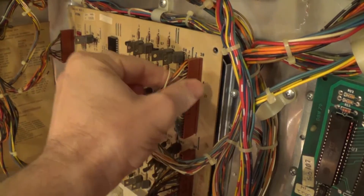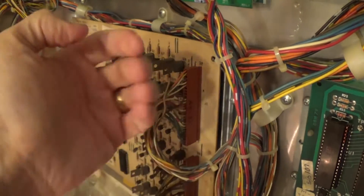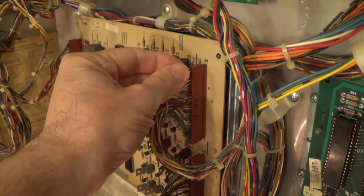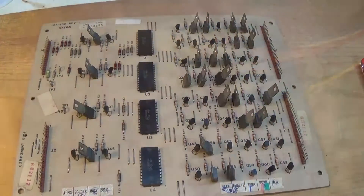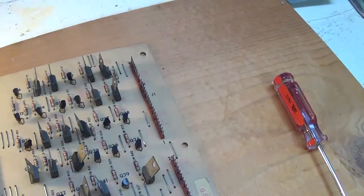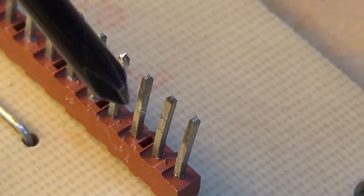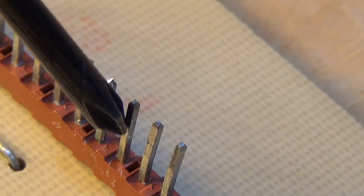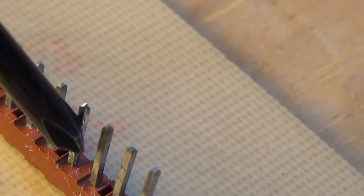So I thought about this actual connector where the wires go in. There's a female end to this connector, and the pins that come out of the board are the male side. I looked at all these connectors — I didn't change any because they all looked nice, new, and in really good shape. I knew it had to do with this plug somehow. So here's the board out of the game. Let me zoom in and show you what I'm looking at. If you look at this connector right here, you can see the plating has worn all the way down. The plating's gone here also. I actually put some solder here trying to improve this one, and it helped a little bit, but it's still having some issues.